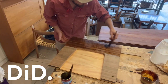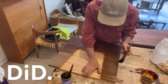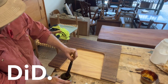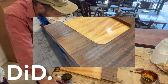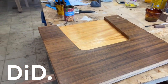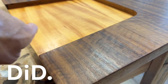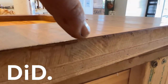Brown shellac — I sort of alternate between calling it brown shellac and orange shellac. Now we're going to use this blonde with a different brush. Nice, even first coat. You want to almost look like there's nothing on there — it's just highlighting the grain. There's not many streaks, no pulling, no runs, and we'll paper that back, get it flat, and start rubbing. As you catch that light, we're trying to just keep it looking natural. Not many brush strokes, especially once we paper it. You can see the laminates — they're veneers. You can see how thin the veneers are in here.